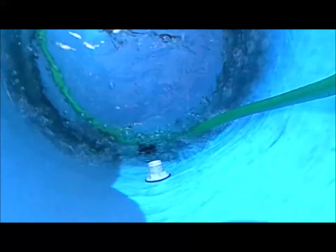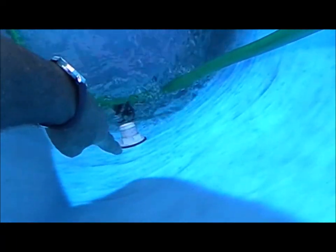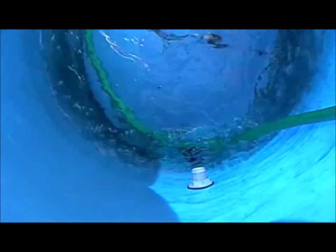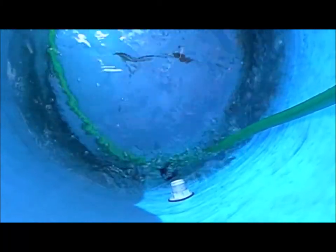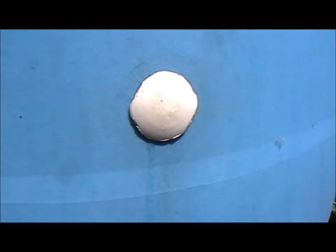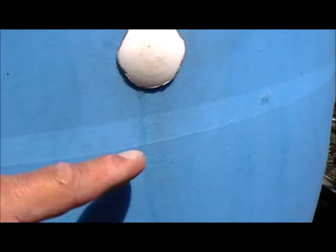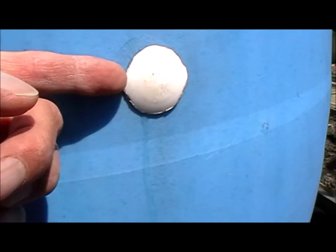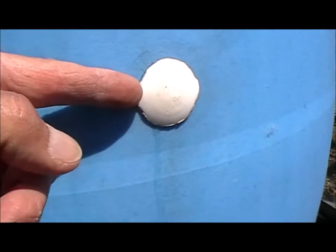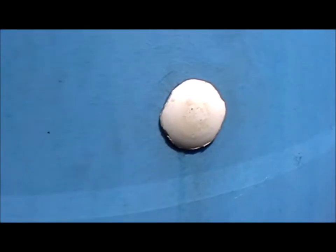While that's filling up - I only need to get it just above the plug really to see whether it's leaking or not - I'll get on and take the other one out, and by that time this should be filled up a little bit. Well, that didn't work unfortunately. I don't know if you can see that, but there's a little leak there. So I think what I'll do is put some of that mastic on - I'll have to drain it down again, take it out, and put some gutter sealant behind this flange.